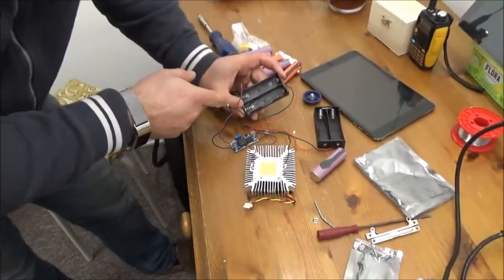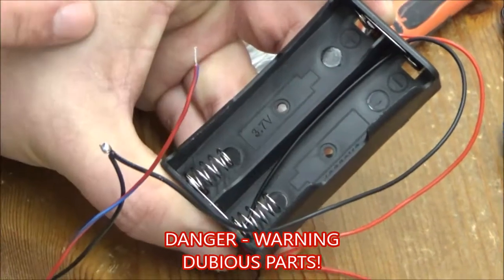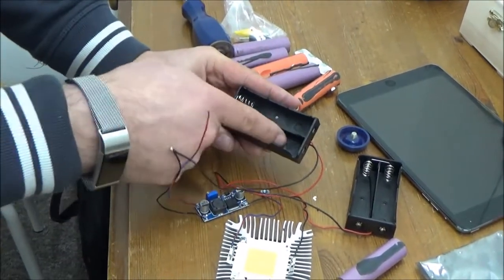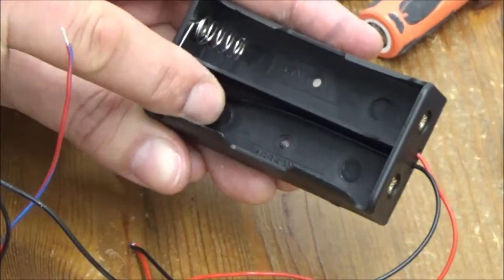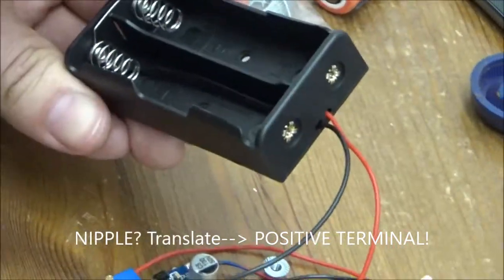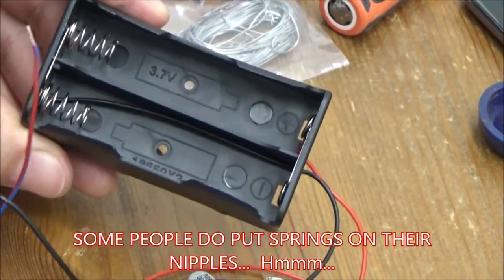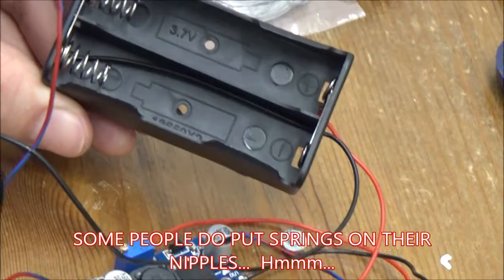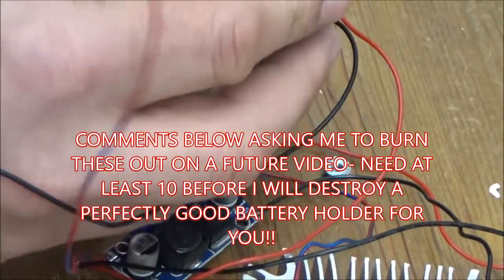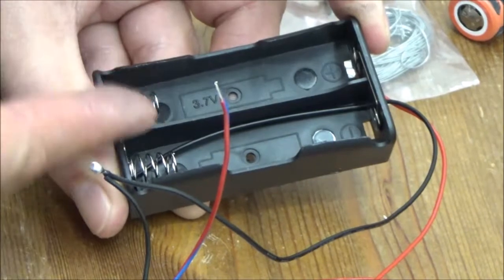Okay, so this is really quite interesting. I bought these on eBay, and you'll notice there's some pictures — hopefully you can see pictures of some batteries in there — and they show the two batteries connected in reverse polarity, so in different directions, which is really quite interesting because normally you wouldn't have a spring on the nipple of a battery. Ultimately, if you look at this, these two terminals are connected together and these two terminals are connected together. If you put the batteries in like that, they will quite literally short out and burn this up into smithereens in a second. Both of the batteries need to be fitted in the same orientation, which I nearly didn't do. eBay purchase — just watch yourselves, guys. Sometimes you might get caught out by this.